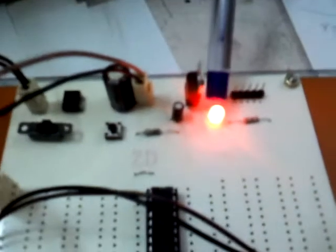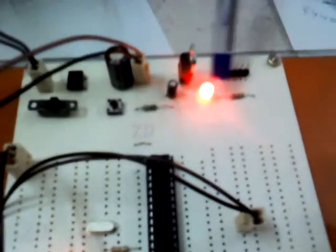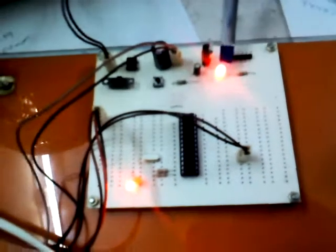These are the 5 programming pins used to dump the program code into the controller. The first pin is the supply voltage, the second is ground, the third is reset, and the last two connect directly to the controller. There is also an LED indicator for power supply indication; since it requires about 1.5–2 volts and the regulator outputs 5 volts, a 330 ohm resistor drops the excess voltage.